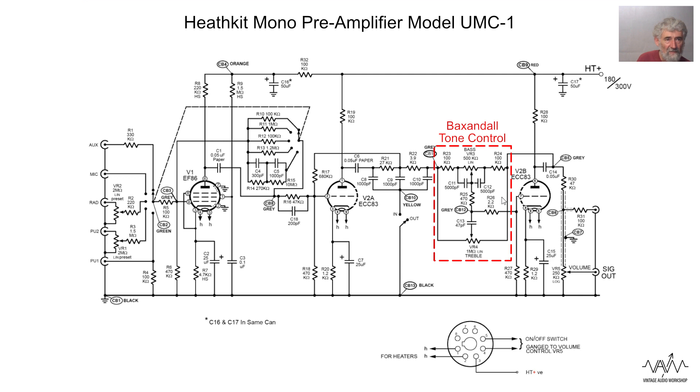You may not immediately understand how it works. It's based on negative feedback. In the middle position, the signal coming from this valve and the feedback are balanced, so the tone control has no effect whatsoever - it's flat. However, when one adjusts the controls to the left, the negative feedback which comes in at this end of the pot in each case is reduced.